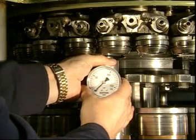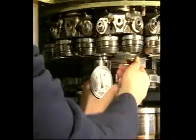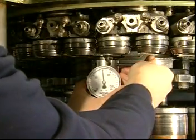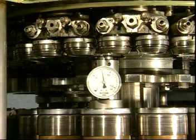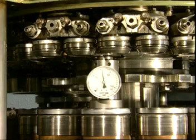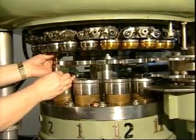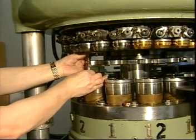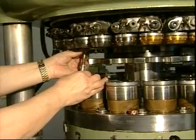There are a number of different types of spring pressure gauges available for this check. Adjustments can be made to the spring pressure if it is found that the pressure is not within the target specified by the seamer manufacturer. Increasing the lifter spring pressure will give a longer body hook. If the body hooks on all heads of the machine are short, the pin height should be checked. To increase the body hook, the pin height should be reduced.